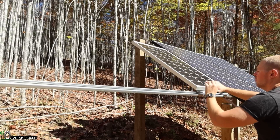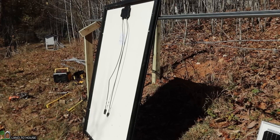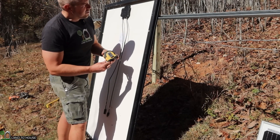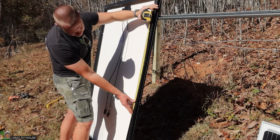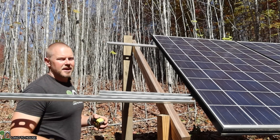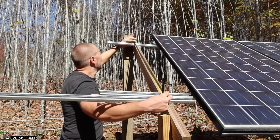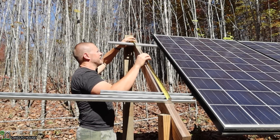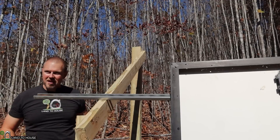I'm going to have to use some really big washers and just clamp around the frame of this one, because the screw holes are in a different position than the big panels. I accidentally pushed the mute button on my microphone, so you get a voiceover. Here I'm just taking the tape measure to see the spacing between the bolt holes on this solar panel, so I can add the other unistrut up top to match that hole and use nuts and bolts to keep the panel in place. I'm using a tape measure to transfer the measurement from the lower unistrut section up to the top — I think it was 39 and a half inches. I'm also adding that same mark on the other side so I can add the unistrut evenly on both sides to match up with those holes.